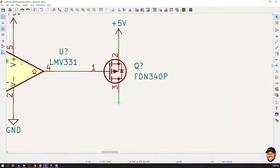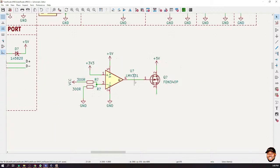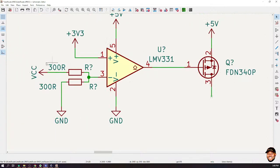Now, what do we already know? When it switches to 5 volts, then we will get VGS to be zero, which will actually not cause this P MOSFET to turn on. That means that this 5 volts here would be conducting, or would not be conducting. What happens, I think I've actually inverted. Okay, so when I connect this, I want my 5 volt to turn off instead. Oh, sorry. I've actually interchanged the signals, I guess.